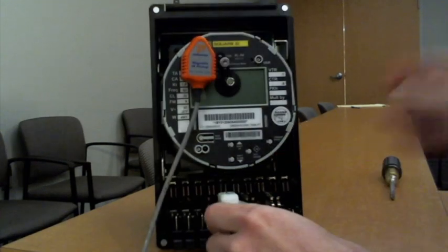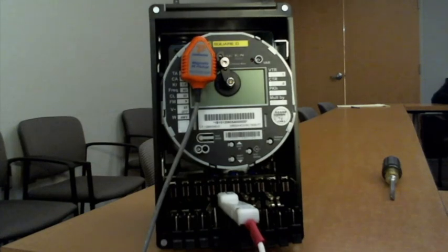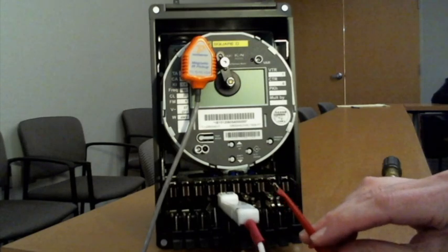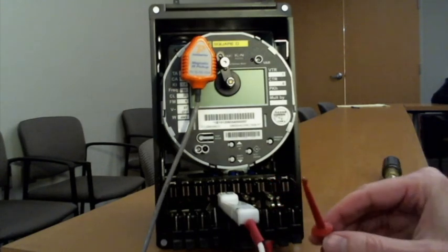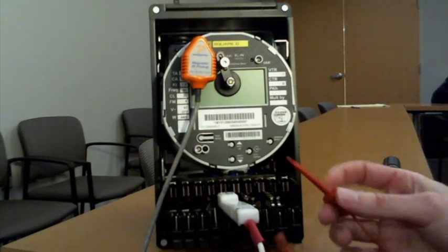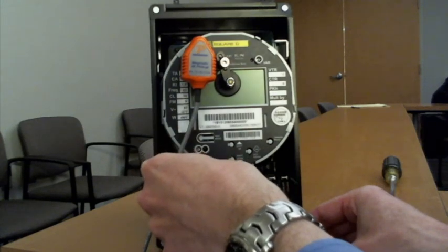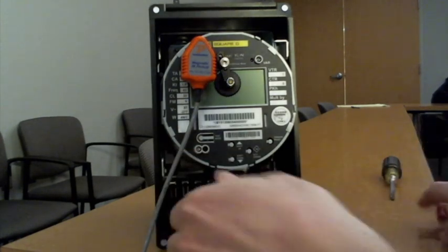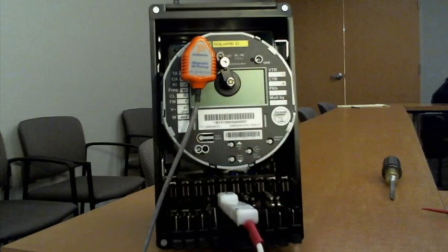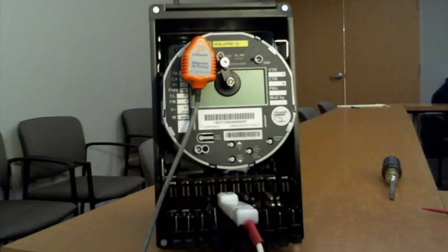And in situations where you have to actually do a load box test, like Jones was showing, we also have very different style jumper leads. Notice these are much, much smaller than those easy hook style jumpers that we showed on the socket-based meter. So those can connect pretty easily to here, so you can jumper across and drive current into the meter itself. Voltages are fairly standard. They come over here and clip onto the edge here, and then you can drive voltage directly into the meter. And with this, we have a suction cup mount that you can use for the magnetic pickup.